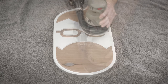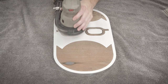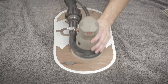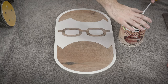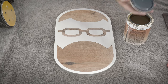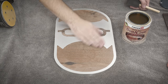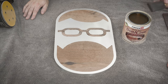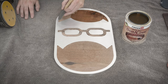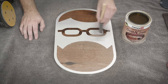When I got up to 220 grit I noticed that the sealer I had put on previously really didn't seem like it was still there. The pores were open, the grain was open, I was starting to get dust into the pores, and the wood just looked like bare raw wood — the same as when I first faced everything down. So I made an executive decision to go ahead and reseal it, not with the water-based product but with this Seal Coat which is a shellac-based sealer. It dries a lot quicker — maybe half an hour to 45 minutes between coats. You just put on a coat, sand it off, put on another coat. I ended up doing this three times to try and build up that seal once again.